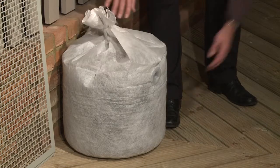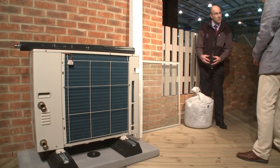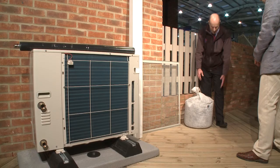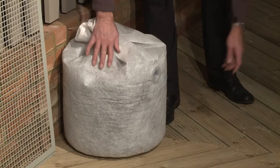Pump House has produced a pre-bagged soak away, specifically sized for all of the heat pumps supplied in the UK. It can take the condensate from defrost and fits underneath the heat pump in the ground. It contains granules with voids between them that capture the condensate when it comes off the heat pump — the heat pump can produce up to 10 litres in an hour, which surges into the bag and is then allowed to release. It's made of a geotextile material that allows the condensate to gradually seep into the ground, preventing puddles on patios which could freeze and become a hazard in winter.